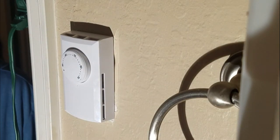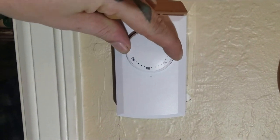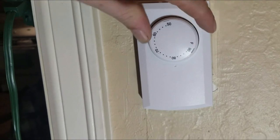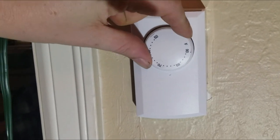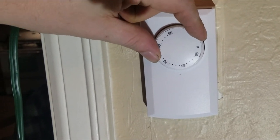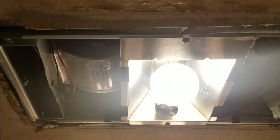The house is at about 74 degrees, pretty hot, so I'm just going to slowly turn the dial. It does turn on right around 76 — it's got to sensitize — and there it goes. It is turning on and off at just about the right temperature. Our fan is working and the heating coils are getting hot. Thank you for watching, please subscribe — more videos are coming.